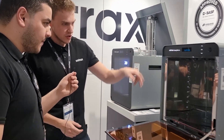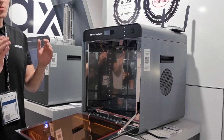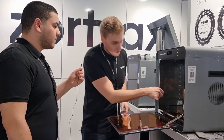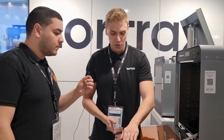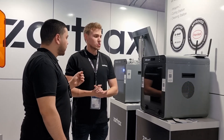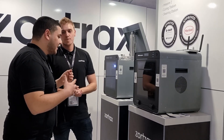After washing, you need to cure the part to achieve the proper mechanical properties. Inside the curing station we have three lines of LEDs plus one line placed upside down, which lets us deliver the same intensity of light across the entire model. Some models are irregular in shape and it was problematic to cure them from one side only, so the upside-down LED line ensures even power distribution across the full build plate. The mirror-like walls prevent light reflections and light loss. A special plate also prevents UV light from escaping outside, which was necessary to meet safety requirements since UV light is harmful to the human eye.